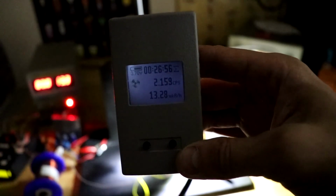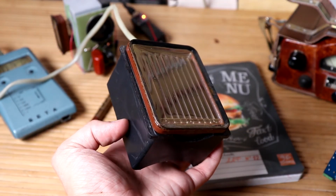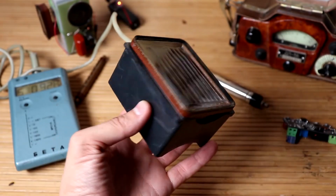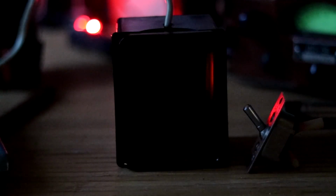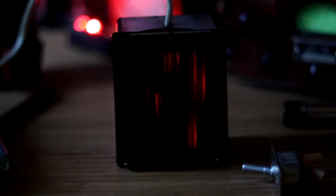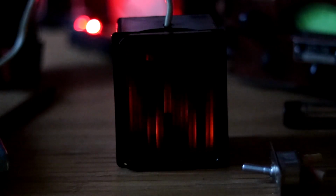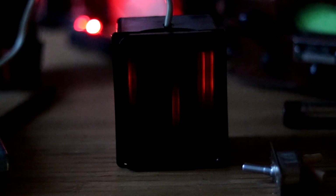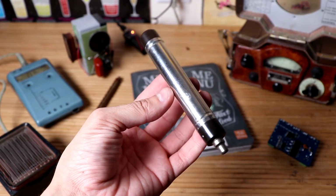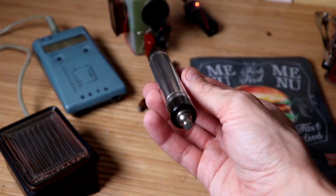Within 10 minutes of measurements, it was not possible to fix an increase in the radiation background. And this is due to the fact that the SBT10 counter is able to detect alpha, beta and gamma radiation and does not see neutron radiation. Inside the ionization chamber, there are 10 parallel detectors, which quickly enough allows fixing the growth of the radiation background. To record neutron radiation, special neutron counters are used. This sample, quite specifically for the experiment, did not work.